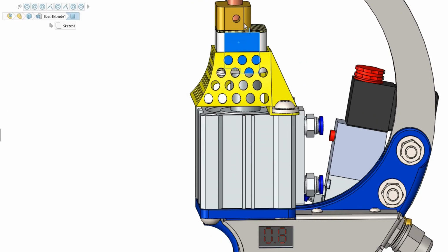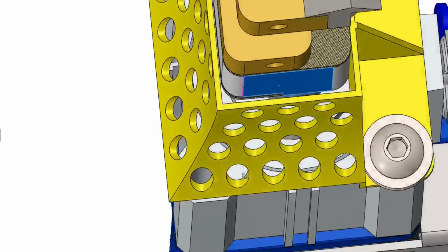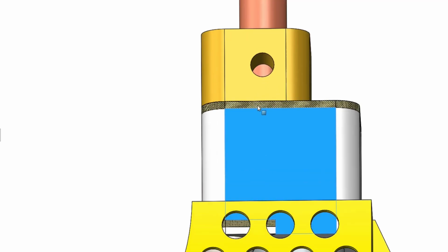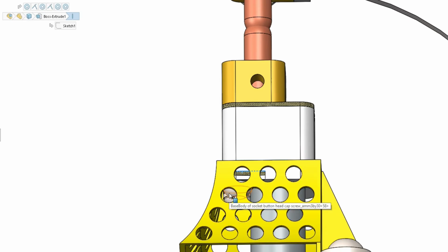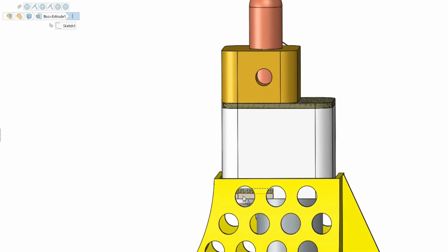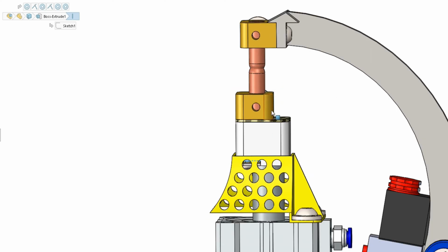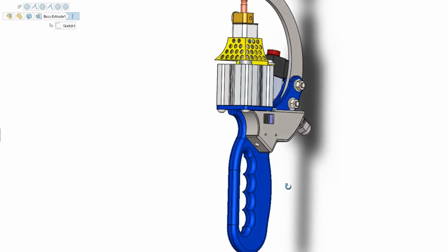So as you can see, the guard stops your fingers from getting in. If your finger hit here, it wouldn't do no harm, because your finger would slide off. This comes down past. Can't nip you because there's a wee gap there, you know. There. Doesn't nip you, but as you can see there's the barrier. There's the other barrier through the guard, and there's the 2 bolts holding the brass block in tight all together. So when the force pushes up, this brass block wants to come this way anyway, because the 2 bolts are at this side. If that makes sense. Mechanical motion. And we're going to now move on.